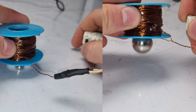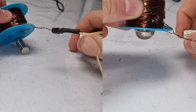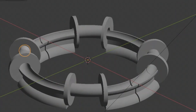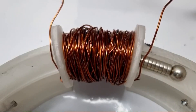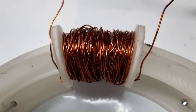Now that you have a basic understanding of how electromagnets work, I can explain how the accelerator works. The idea is that an object accelerates in circles within a track. You can't simply leave the coils always activated because they will heat up and melt the track. And even if the track was heatproof, keeping the coils on won't accelerate the magnet. Instead, the coils will let it oscillate back and forth until it's centered in the middle of the coil.